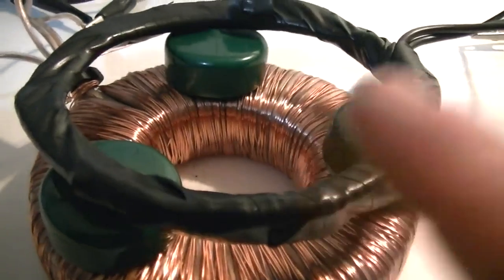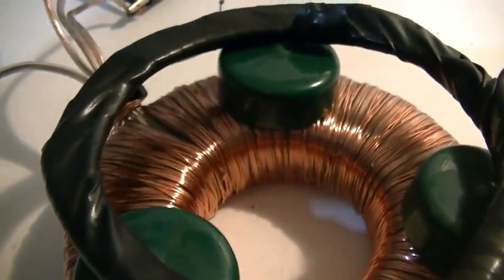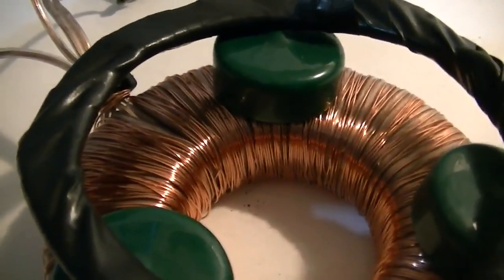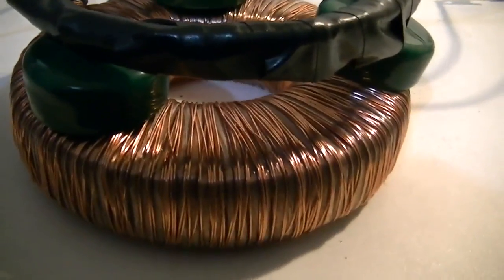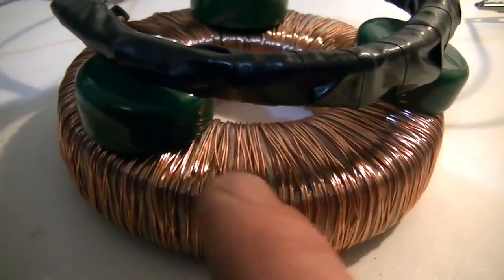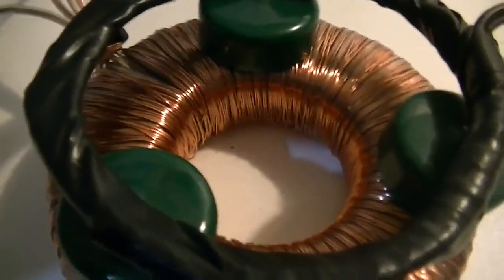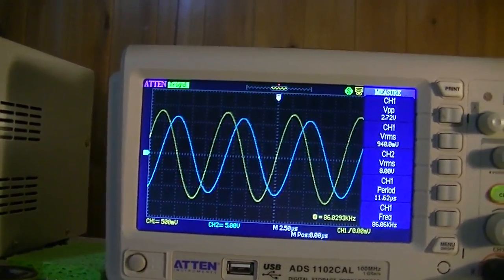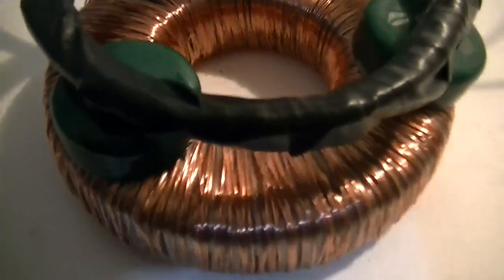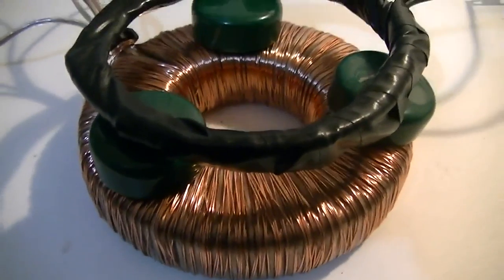I think the rise and fall with the magnetic wave within that core would look a little different on our secondary. I'll see if I can hunt down a large ferrite core that's non-magnetic — that doesn't have a magnetic field — and we'll try that as well. But I don't think that's going to be interfering, because if we look at the way that the magnet is magnetized, the bottom half is one field and the top half is the other, so they'll kind of cancel out any effect. So there definitely seems to be a magnetic field emanating outside the core and not concentrated within it.